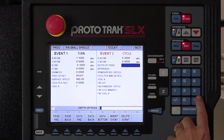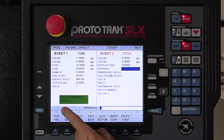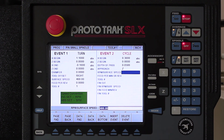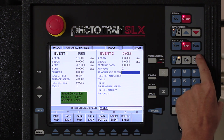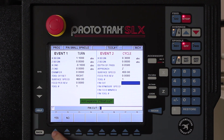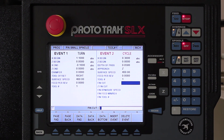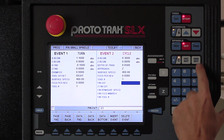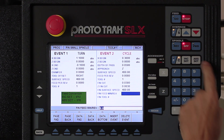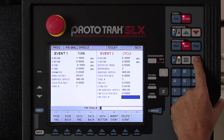The rest of the questions in the first event for the cycle are asking me how I want to do all my material removal. I'm going to tell it depth of pass — I want to use 50 thousandths per cut. The approach is asking me if I want to use the X or the Z, so I'm going to use the Z axis. My 400 surface footage is already in there, so I can just hit the absolute key. I'm going to put in my feed at eight thousandths per rev and still use tool number one. At the finished cut, I'm using the help key to add a separate finished cut for the faces. I'm going to put 30 thousandths as my basic finished cut on my diameters and only leave three thousandths for the faces. I'm going to use 400 surface footage, lower this to 6 thousandths per rev, and still use tool number one.